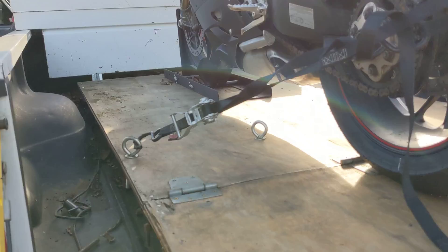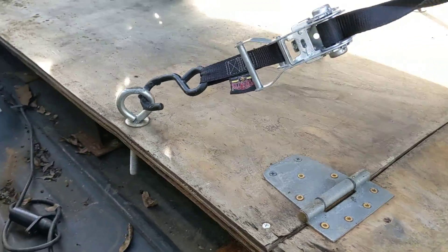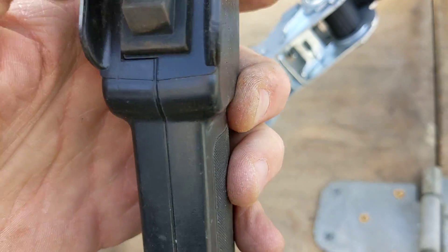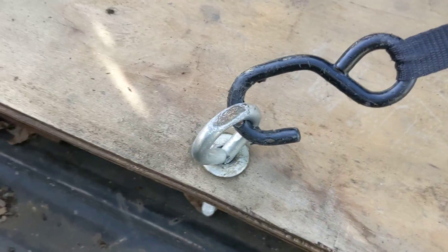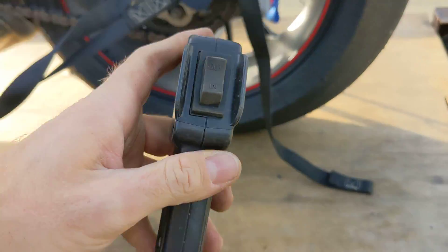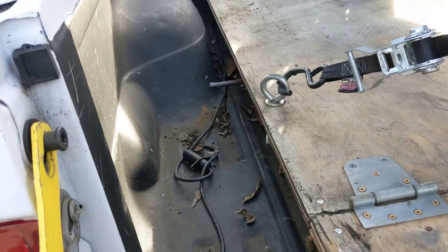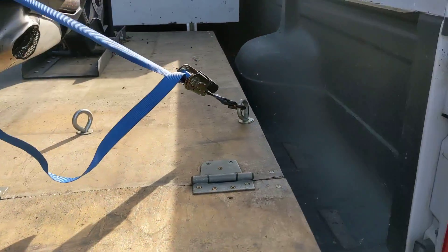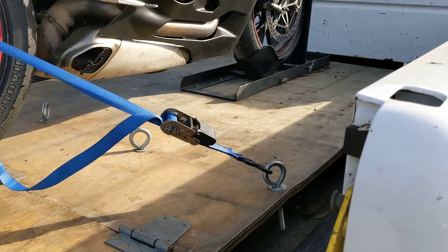I have these pins which go into some plates on the side, just to lock the ramp on. I just need to adjust the tension here, slide the pin in, and once it's in I just tighten — just one click — and that keeps it from coming out. I'm redesigning that mechanism to make it a little bit easier and not relying on the winch to hold it in, but there's one on each side basically to keep the ramp from flopping up and down.